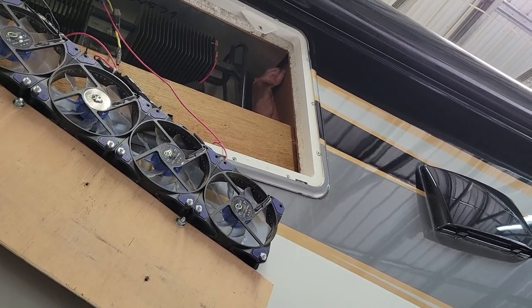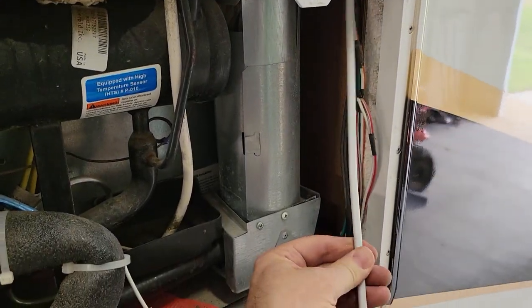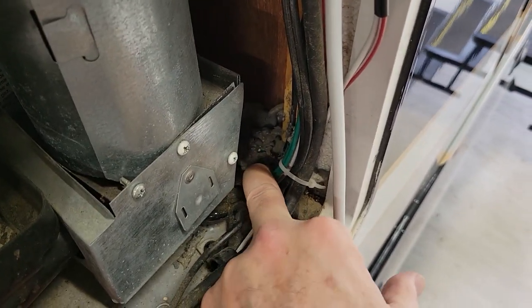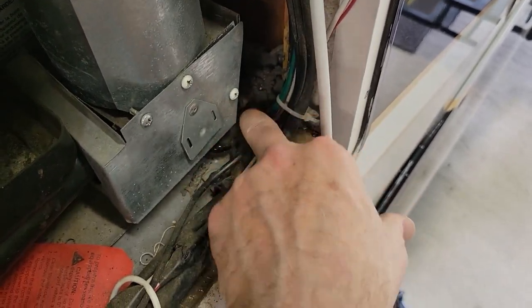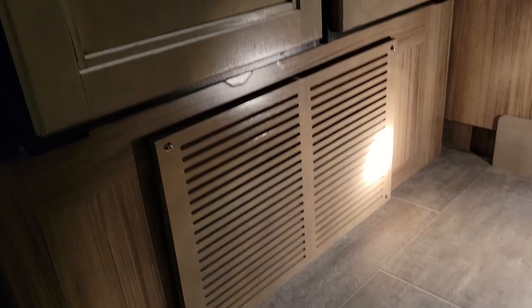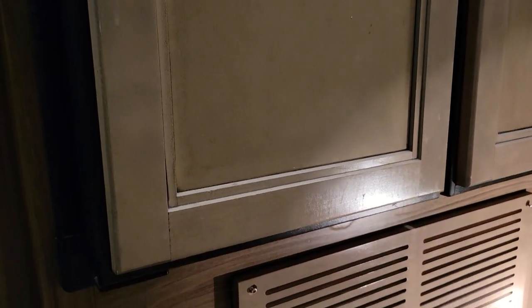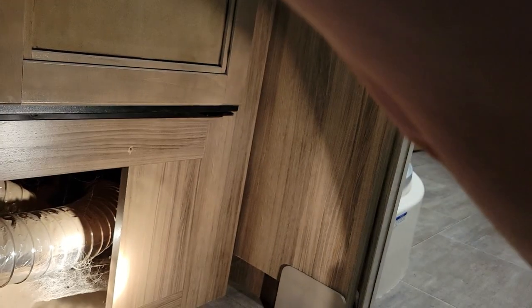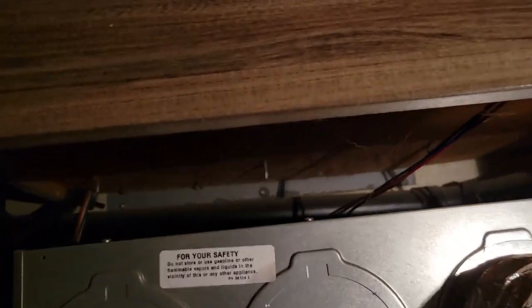Got the wire fed from the top of the refrigerator, behind the wall, and down here. The tricky part is that foam insulation right there has to come out so the wire can go down through the bottom of the refrigerator floor where the furnace is. On the Seneca 37 HJ, the furnace is underneath the refrigerator. There are four screws - pull off the plate and there's the furnace. I'm going to be working way back in there - those multicolored wires coming down are what I'll be feeding the cable through.